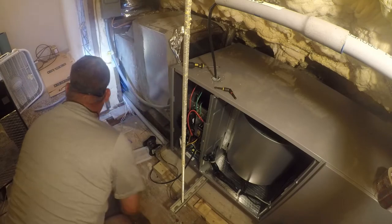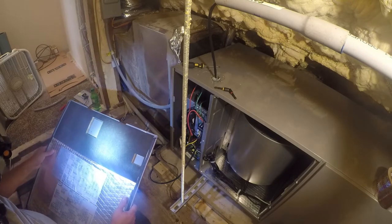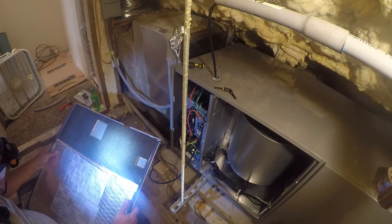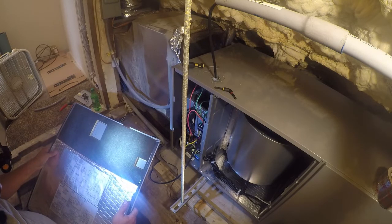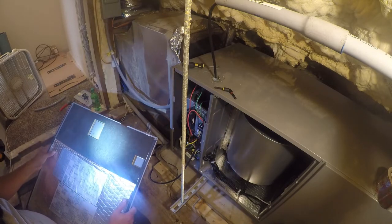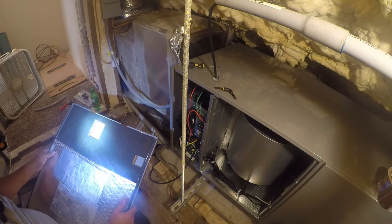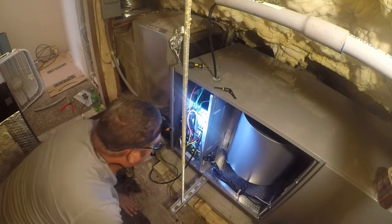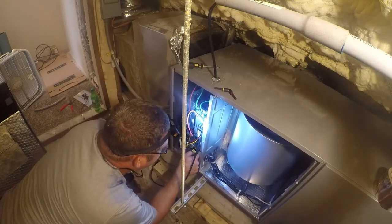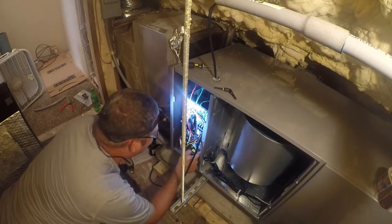All right. I gotta look at the wiring diagram. Connector number 3. That can't be it. There it is. Connector number 20. S1, S2, and ground. All right. Well, where is connector number 20? Ah, so it's up in here. Where the hell's ground?